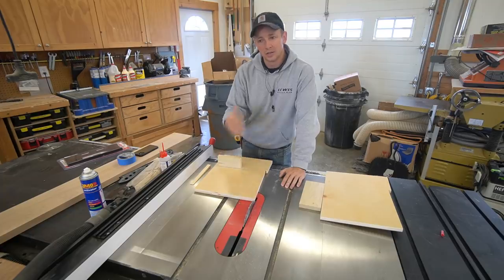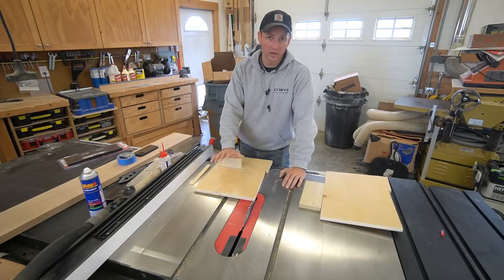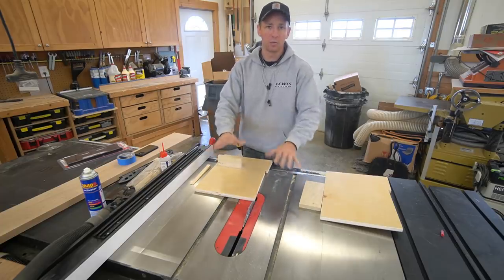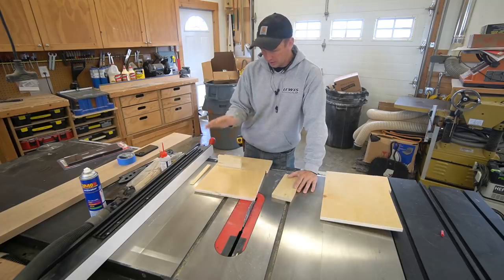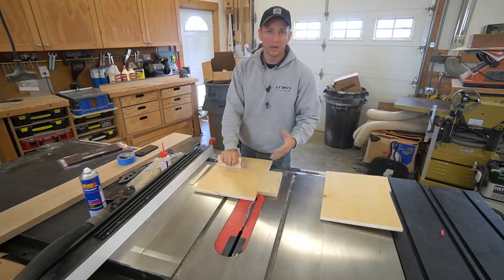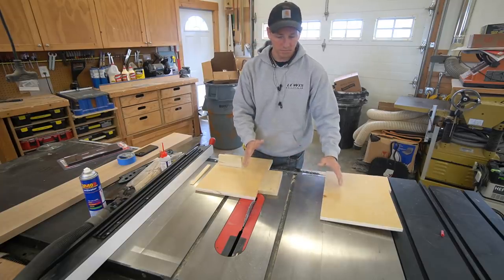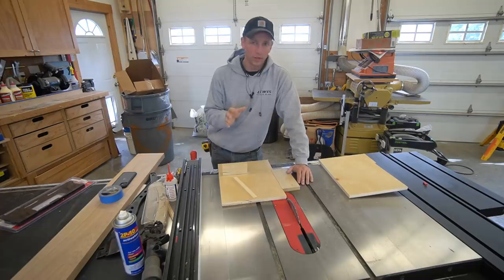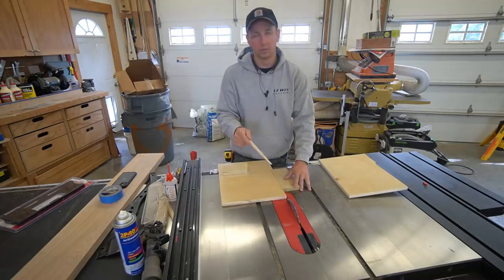You might not think of shims as exactly rocket science, but this would be a very high probability task of cutting a finger off on the table saw. Anytime you're doing a repetitious task, your chance of hurting yourself goes up at least ten times — if not a hundred times — because of that repetitious nature. Your brain just kind of shuts off. So keep that in mind. Obviously we've got our right hand over here, but my left hand is still in play manipulating the workpiece. The wider the workpiece I can use, the more it's going to keep my hand away from the blade — this one-by-four isn't a great example. You also have to watch out for whenever you're making wedges: the thin end can actually fall down into the insert and around the blade and cause a lot of issues.